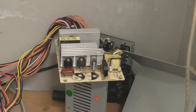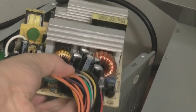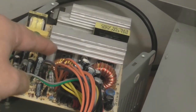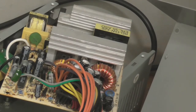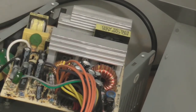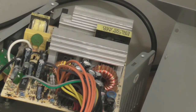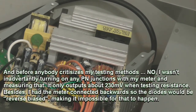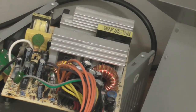However, with the rectifiers on the other side of the power supply, it's a completely different story. On this side of the board we've got three rectifiers — one there, one there, and behind this coil there's one there. I'm getting an unusually low resistance when I measured between the cathode and the anode of each of these rectifiers. For instance, with this one on the end, I got a very low resistance of about 14 ohms, which is not what it's supposed to be. We should get a low resistance at first, but then it should start going up as the capacitors charge. I know I was testing these while they were in the circuit, but there's just no way I can get those out.